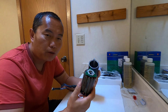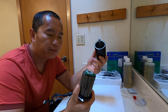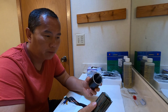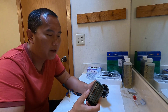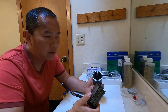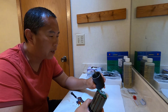Hi guys, I'm going to waterproof this OutRunner brushless motor today, used for the water. Usually people use the InRunner motor — a completely sealed motor for underwater. But generally speaking, the OutRunner is more efficient, especially when the motor has a very small diameter.